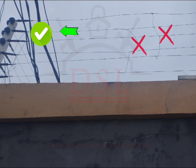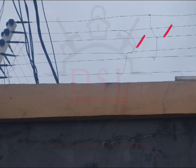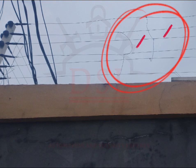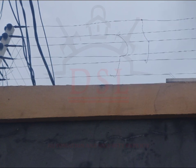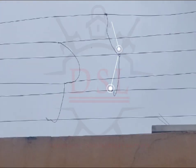Your looping ought to be at the extreme — the edge of the fence, where you have this pole. Take a look: this is the edge, this is the corner of the pole. Your loop is supposed to be here. Having it in the middle is outrightly wrong. There's no termination point in the middle — how can you have your looping done there? Please go back to the earlier video I made. This is the basis for the safety and security of your client. Your looping ought to be at the edge, not at the center.